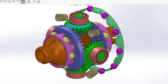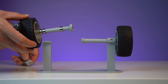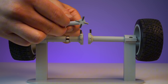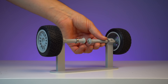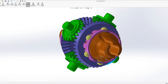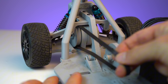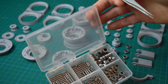You can see how the four spider gears and both bevel gears orbit the virtual point at the center of the assembly — I like to think of it as the black hole at the center of the Milky Way that everything orbits around but is not visible. The other components are bearings that allow everything to rotate with minimal friction. This differential has eight separate bearings: four for each of the spider gears since they need to rotate independently, two larger bearings on each of the orange outputs so they can rotate relative to one another, and two large-diameter bearings so the whole assembly can spin in unison when both wheels are going the same speed.